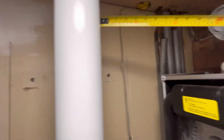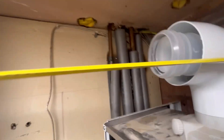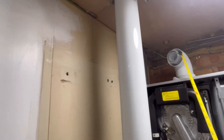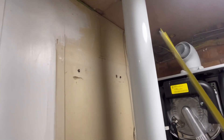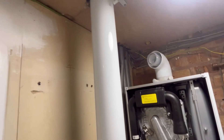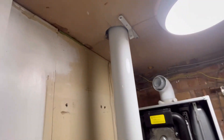What I'm going to do is measure the flue. That's what we've got there — 368. So that's from the edge of the flue to the edge there, and add on how much it goes in. That's how I fit the Vaillant, so it just butts up right to there. It's got to be bang on 368. Let's cut that down. I'll put my elbow on and measure that one and get that old bracket out.